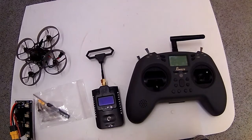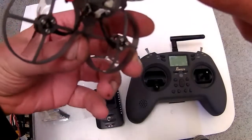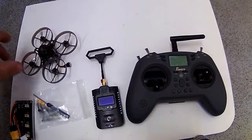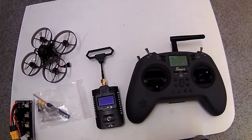When I did it, I got the bound light which stayed solid red — it's around here somewhere; I usually look through here and can see the light come on. I had stick movements but I didn't have any switches working. After a long series of mucking about, the answer was in front of me all the time: in BetaFlight I got a red flag warning saying 'calibrate accelerometer.' As soon as I did that, everything worked. I set all my switches and didn't download anything or change the Lua scripts. This is all done without a computer.